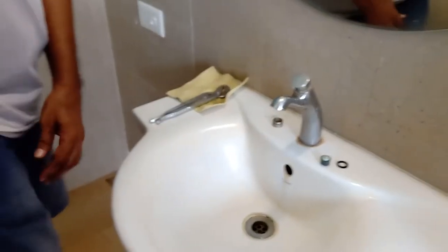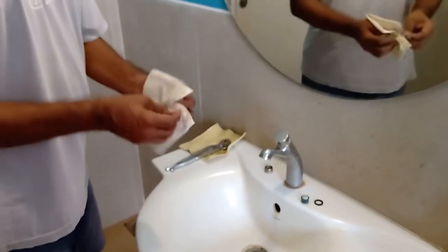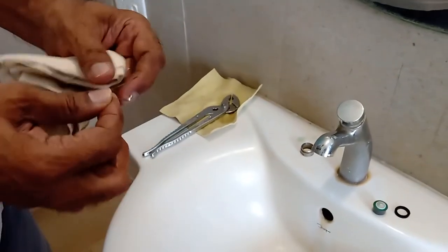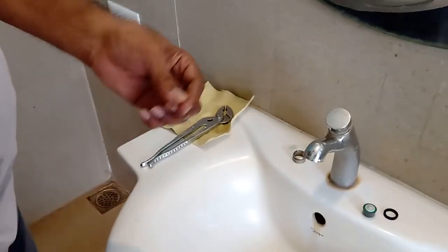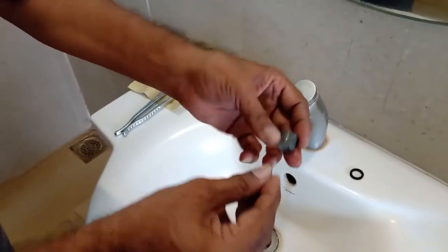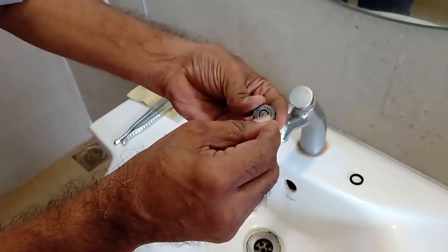Keep the opening here and just tap it. In case debris doesn't come out, I normally use a safety pin. But make sure the safety pin is not sharp — its tip should be blunted — so that it doesn't damage the inside. This membrane is important; do not damage this membrane. Just poke in the holes to clear it.